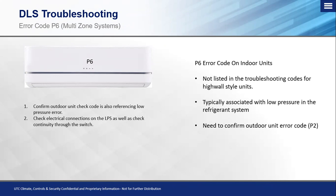If you're tripped off on a high pressure or a low pressure code, that switch will be open, so don't get confused in your troubleshooting process by improperly diagnosing a switch that is supposed to be open and tripping off this code. You want to verify that the system will eventually reset. Typically, with the high pressure, it resets at about 490 PSIG, and 44 PSIG on the low pressure side. We want to make sure that the switch has reset, then cut power to the system and test for continuity through it. If there's no continuity once the system resets, or the error code never resets itself, chances are you've got a failed switch and you'd need to replace that high pressure or low pressure switch.